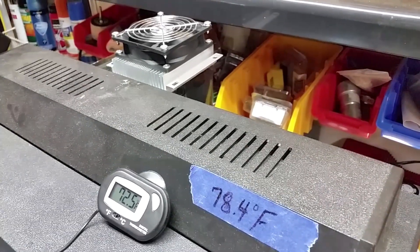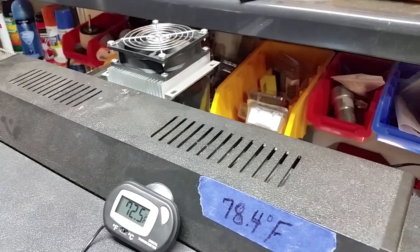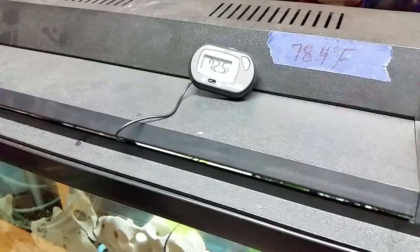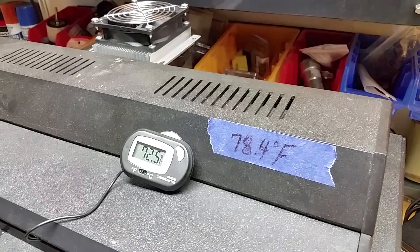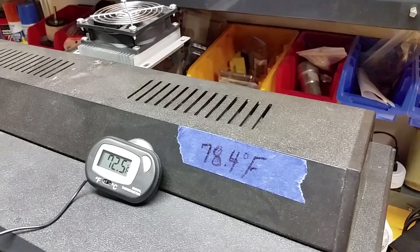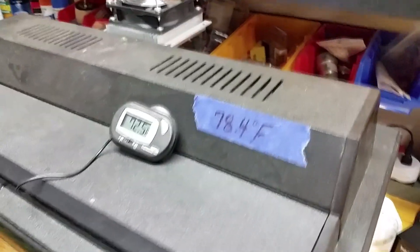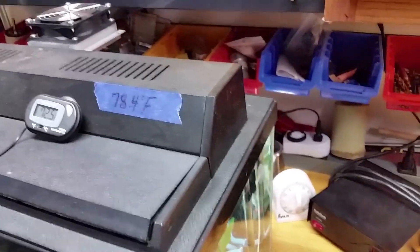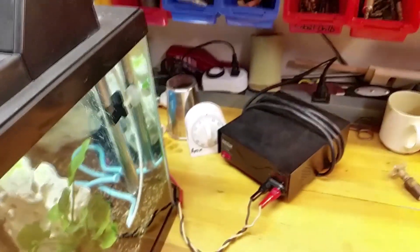I'll look into it further, and I'll also try to post the Peltier junction cooler assembly that I bought off eBay — it came from China, and it came with a fan, the heat sinks, and the Peltier junction. On a 10-gallon aquarium, for that kind of temperature drop, I think I'm okay. If it could reach 83 or 84 degrees Fahrenheit in this garage, this little cooler should do the trick. I don't think it was much more than $15 shipped. The only expense is a 12-volt power supply — you'd probably want at least 5 amps just to be on the safe side.